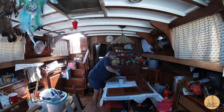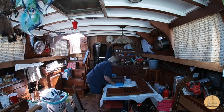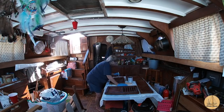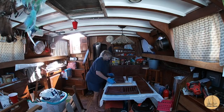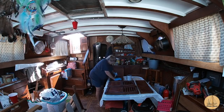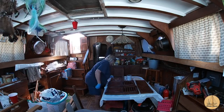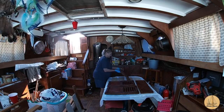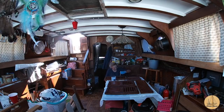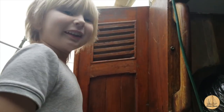One of the things you've likely noticed in the salon is the lack of cabinet doors. As we varnished and put up the new ceiling, Deb has been working on varnishing each of the doors. They're not easy — they are latticework, so it's a very intricate varnish job. It's really easy to get runs in between the components of the latticework. She has spacers to keep the varnish from going down onto the surface and varnishes each of the doors. She does three to four at a time, lets them dry overnight, and then we install them the next day. It's been a slow process — probably half of them are done.